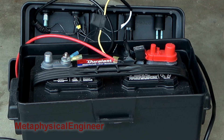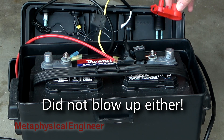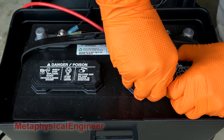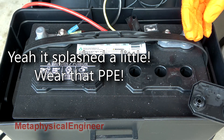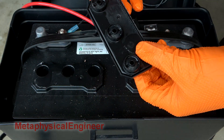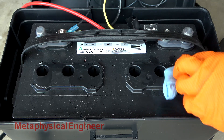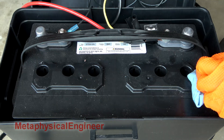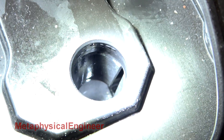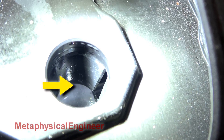Contrary to all the naysayers, the off-gassing of the battery has not yet corroded all the terminals into nothing. I've got gloves and eye protection on. Time to get these vent caps popped off and see where the electrolyte's at. Not sure if this is acid splash or gases that have recombined — I really don't want any of this going someplace it shouldn't be. Getting both my eyes and the camera lined up with the flashlight is a little bit tough. You can see the water should be right at the bottom of those tubes, right where the notch begins.